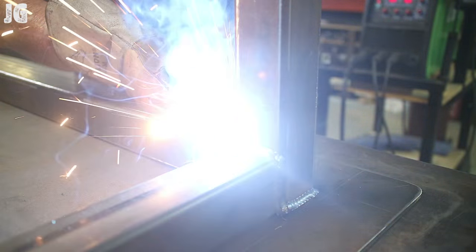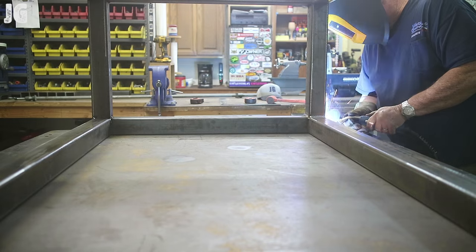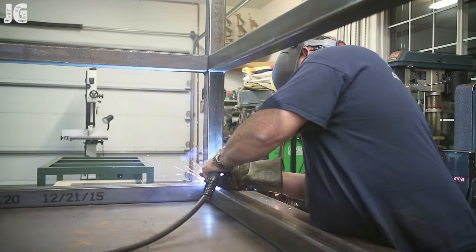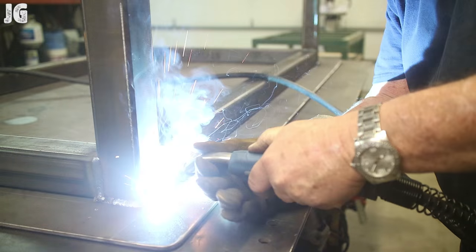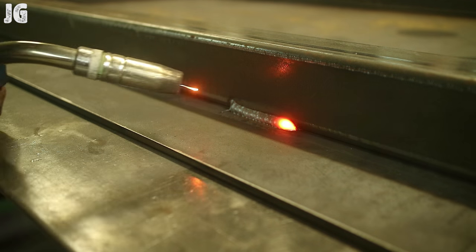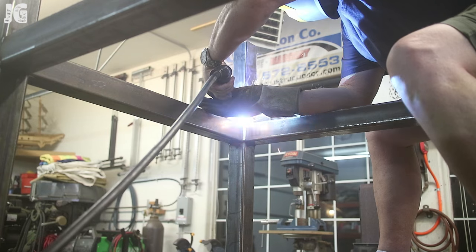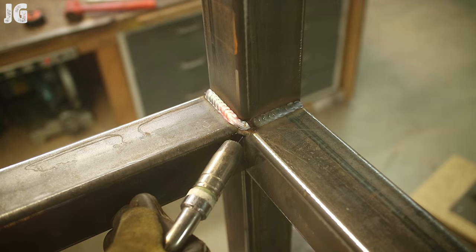I started the welding and I'm moving along pretty good. There are a lot of joints to weld up. I'm using the Everlast PowerI-MIG 205 with settings at about 18½ volts and 250 on the wire speed, using 30 thousandths wire. Every machine is different — that seems to work best for my machine. Everything is turning out really nice and the welds are pretty clean. Being a big guy, the best thing is to be as comfortable as you can for welding — I actually had to crawl up and straddle the table I'm making to get the welds all done, but we managed.